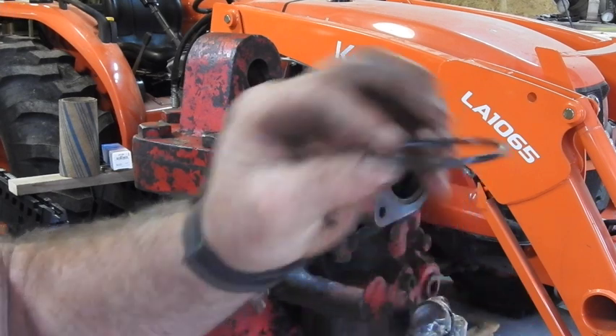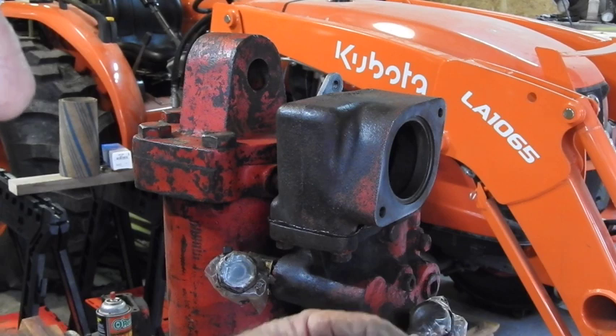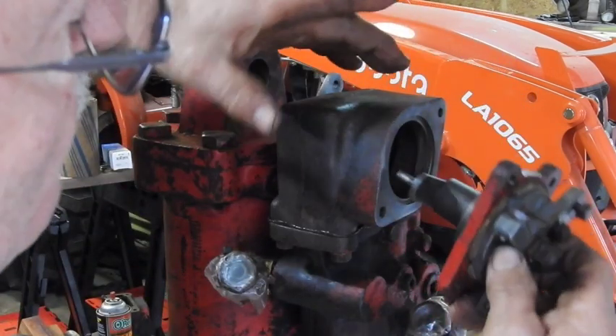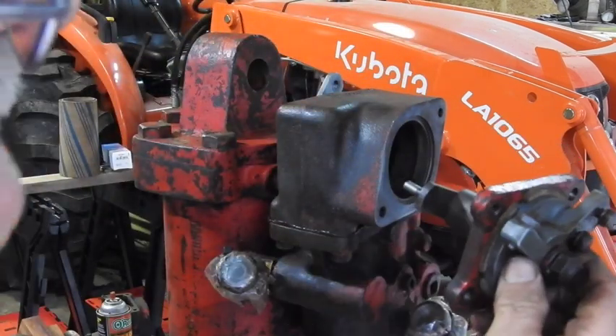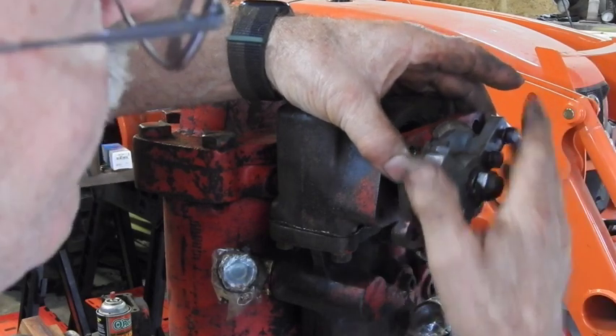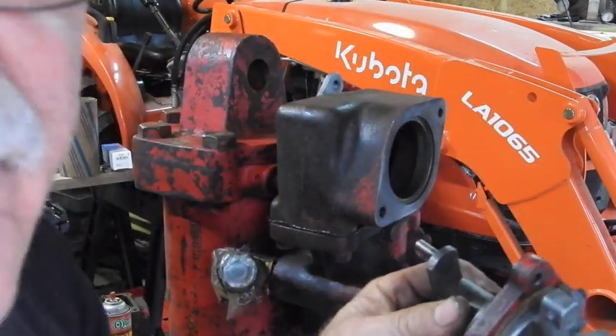And of course I've got an O-ring here. It's in good shape, so that's going to be okay, but there's no other gasket on this particular surface. You can see the O-ring indentation, so this is going to have to go in here and this will rotate about this orientation here, and that allows the quadrant to be in the rear position, which would be up. So anyway, I'm going to have to ferret that in there.